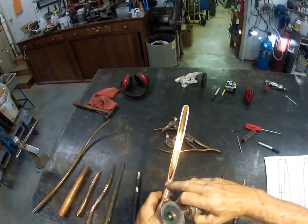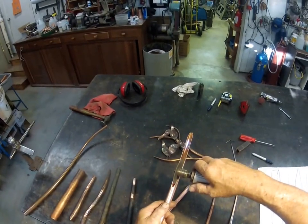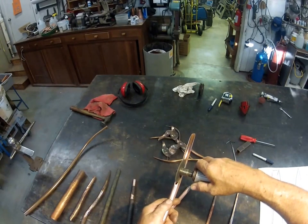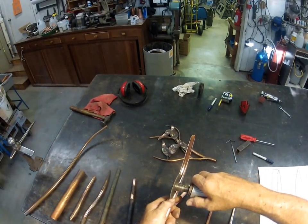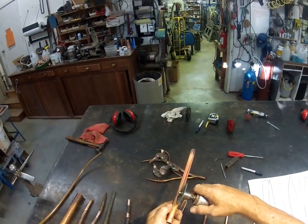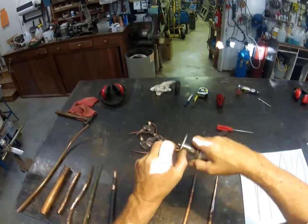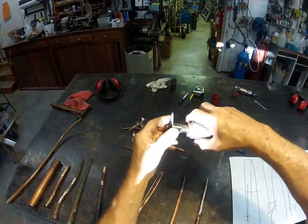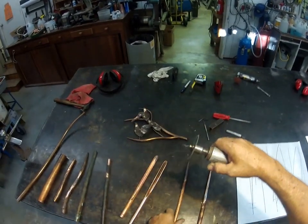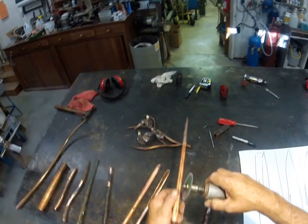Take this piece — it's got this nasty little ski jump habit here. Put the back side of the cutter head up against the back side, or the opening edge, of your cut, and let it flow. Cut, cut, cut, cut up to the point that you come out at zero — the zero point where you can't get any thinner. Use the cheapest, thinnest 3-inch cut-off wheels you can buy. Cheaper is better because they're thinner — cheap Chinese junk. It's the one time that cheap junk is actually to your benefit.